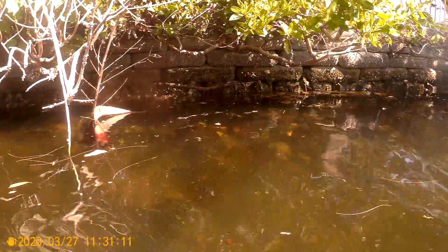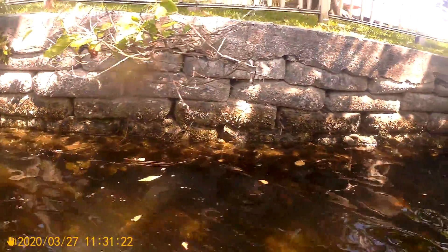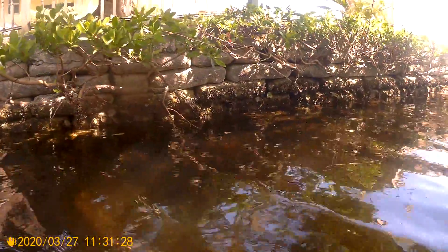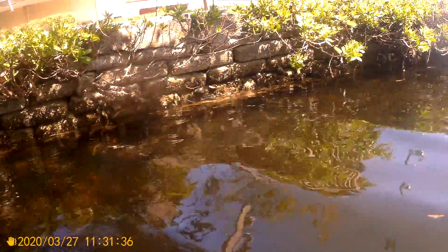The vegetation is actually anchoring the wall to the land side, but there is a need for attention. You can see many areas with the footer exposed and sand coming underneath it — sand coming through the actual gaps in the riprap bags and where vegetation has penetrated through. It's a curved wall going over a corner property.